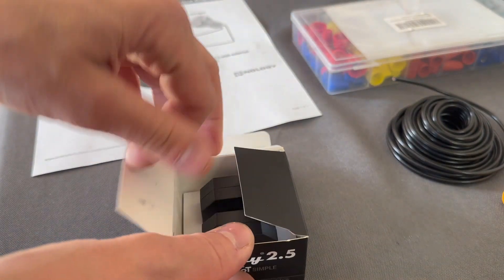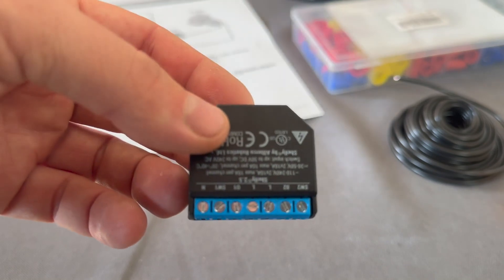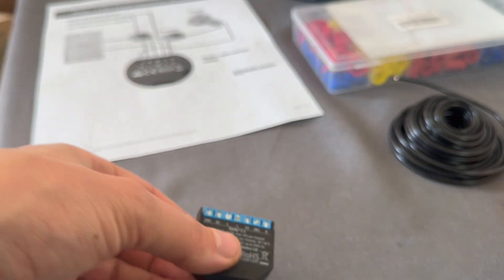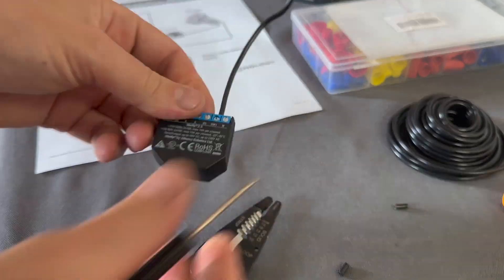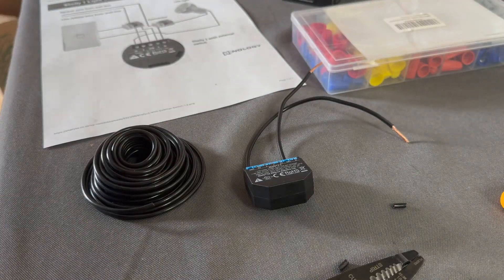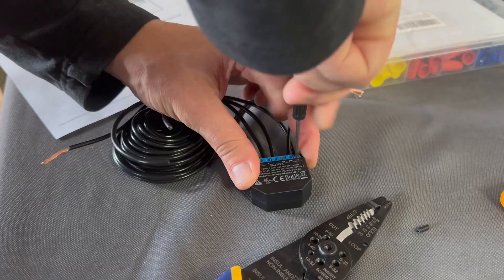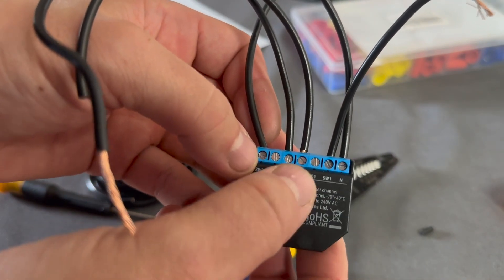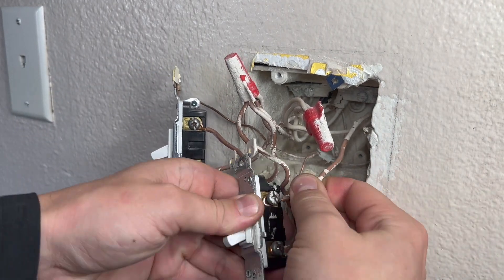Jumping over to the table, we can go ahead and take one of our Shelly 2.5 relays out of the box. What we're going to do is hook a jumper wire up to each of the ports, except for the outputs 01 and 02. Make your jumper wires long enough so that they're slack to hook everything up and push it back into the electrical box in the wall once we're finished. Once we've added all of our jumper wires, we should have all the slots filled except for 02 and 01. Let's now remove the wires that run from the switches to the lights in preparation for connecting to the output ports on the relay.